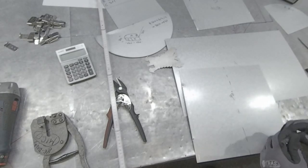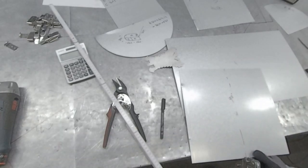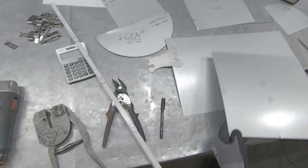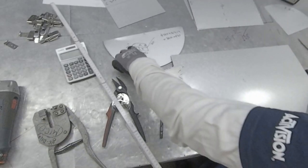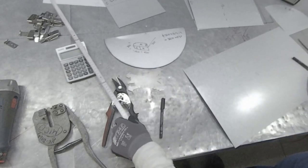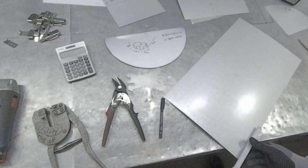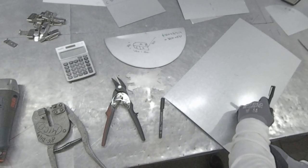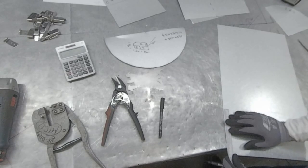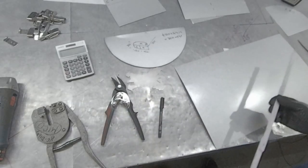I'm gonna bend it 90 degrees. Here comes the S for a switch, so where I'm gonna bend it later I'm gonna punch a hole in it — and also on the other side. The upper part also comes 160, and I gave one millimeter more so it's 161. That's my experience. You can also give 160 — it depends on what machines you have. Different sheet metal workers may have other systems.